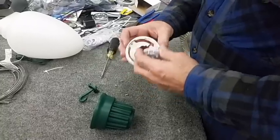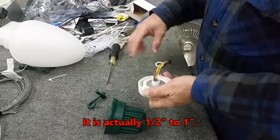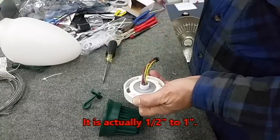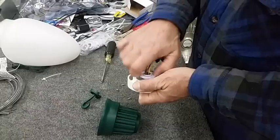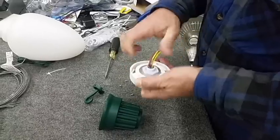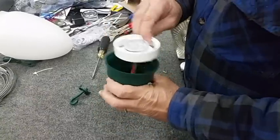We just stick this guy in here like this. This is a reducing washer, half-inch to one-and-a-half, for electrical. I put it so that the hump is out, so that when we tighten it down, it springs down and loads up the nut, keeps tension on it. I just tighten this down by hand and put it about in the center by eyeball, then put this guy back in here.